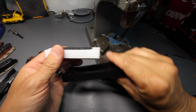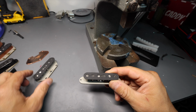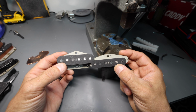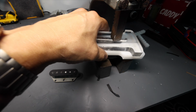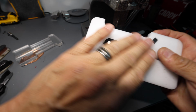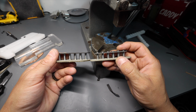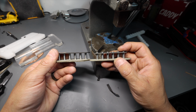So now here is the first spot where the Telecaster and the Stratocaster pickup diverges, because we have this, right? And they look kind of the same. Yes, it looks a little lopsided. Don't worry about it. We're going to fix that in a minute. But see, they look basically the same. Maybe just a little bit different size, but they look basically the same. But here's where it starts to get a little different. I'm sure you've seen this in the past, when you look at a Strat pickup, the magnets stick out the top, which doesn't seem like that big a difference. But in the grand scheme of tones, it is. So if we use the same size magnets for both pickups, you'll see now that that coil is just a little bit shorter.